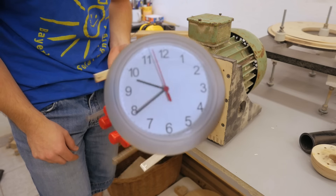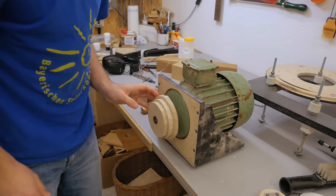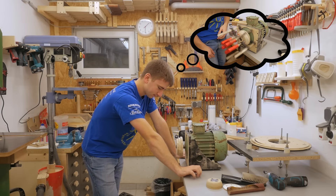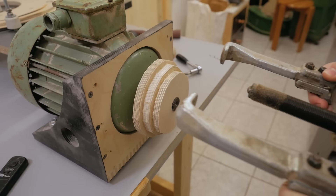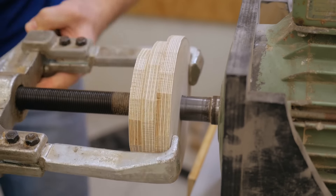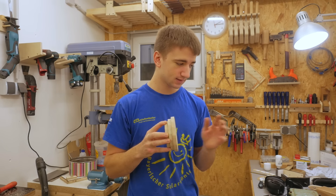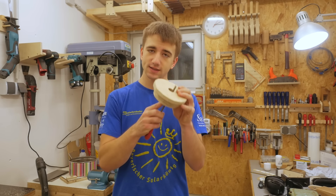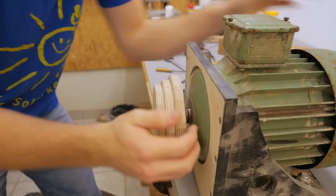Hopefully I can get that off again. Okay, it's the next day now. I need to get the flange off again to cut the slot for the keyway. Some tasks just require the right kind of persuasion. Maybe it was the glue squeeze out. I expected the discs once they're glued together to fit very tightly and maybe have to use the gear puller, but I didn't expect them to be that tight. To not always have to use the gear puller I took a small file, filed the hole a little bit bigger, and now the fit is really good and I can still get it off by hand.